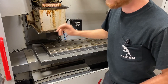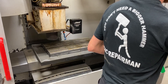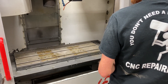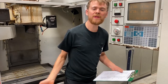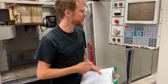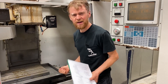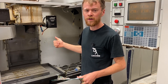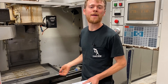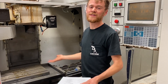Going to do a quick check of the axis motion to see how the ball screws, support bearings, and thrust bearings sound. The way I'm gonna do that is G28 each axis by itself. On this particular machine it did them all at once — the majority of newer machines you can do them individually. This machine didn't sound great. Z sounded kind of gnarly, so did X and Y. There was some way cover binding I heard. If I'm gonna be running this at full rapid making parts every day, I'm gonna get tired of hearing that. Probably got an old worn-out machine, but it is what it is.